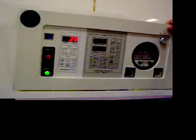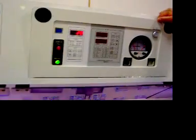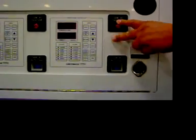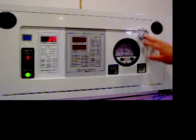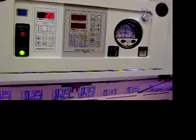There is a slight difference between the Amerimade controllers and WaveFab controllers. The remote reset is not on here. It's only an indication. On our controllers, we have a remote reset for the high limit, but those can be reset right on the controller itself. The difference is the user doesn't have to open the door to reset this. It can be reset from the front panel. But the Amerimade controllers, you need to get into the head case to reset.